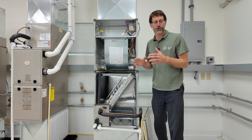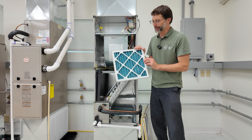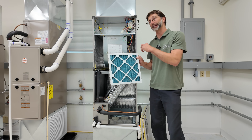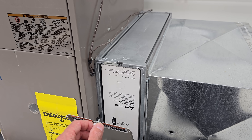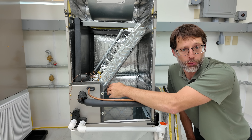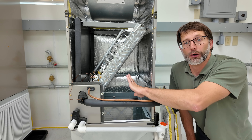You could also have an airflow restriction. The most common is a clogged filter — you could have a clogged pleated filter. Some homeowners are strangling their unit by trying to install a very high MERV-rated filter in a one-inch filter slot. That doesn't work because you don't have the surface area to allow adequate airflow without an extreme pressure drop. If you want high filtration for dust, pollen, and pet dander, you need a four-inch filter in a four-inch filter cabinet. You could also have airflow restricted at the underside of the coil, clogged with dust due to having no filter at all, a cheap fiberglass or hog hair filter, or air traveling around the filter.